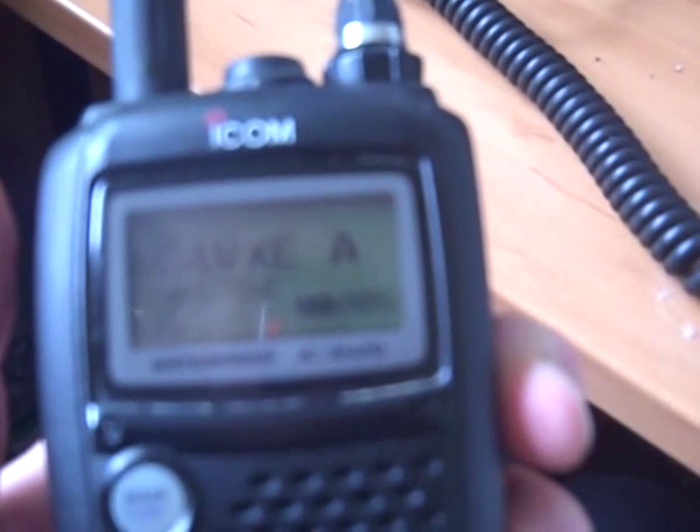What we'll do now is connect the DV App up to an Australian repeater — I had some activity on there a second ago. One of the nice things on the E92 is that you've got callsign memories, so I should have one to connect to VK3RWN. In the callsign memory you put the callsign of the repeater and the port — in this case it's Port C, which is on two meters. The port system is: A is 1.2 GHz, B is 430 MHz, C is 144 MHz, and then an L on the end to link it up.